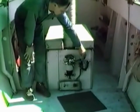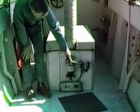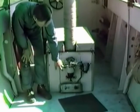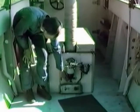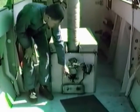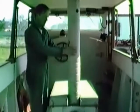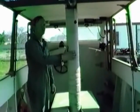The fuel goes through a valve or electric fuel pump, and that's through a Dahl filter, which is a three-stage filter with a clear nylon bowl and a petcock for draining off the water. The fuel return from the engine comes through this manifold and is selected either to the port or the starboard tanks. It's a hot stack with a stainless exhaust system, and the muffler, stainless muffler, is here.